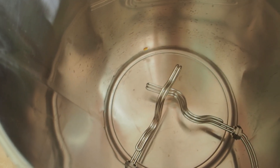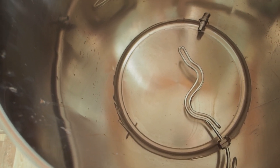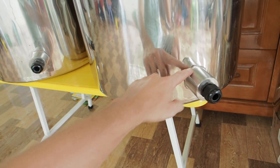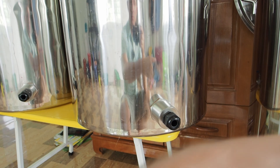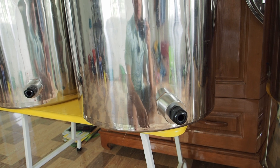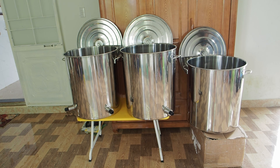I should say wort - sugary brown wort. The hot liquor tank has one 6,500-watt heating element, welded onto the outside with a special sealant and bolted on, all stainless steel, with a watertight cable gland that connects to the electric box via three-core cable with an earth inside. The mash tun isn't complete yet as there are still a few things to do inside, but that is the brewery system as it stands.